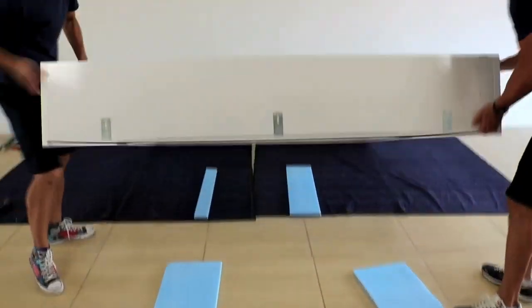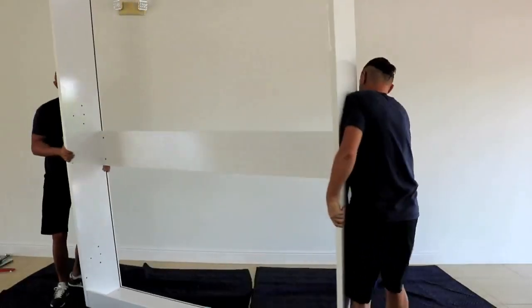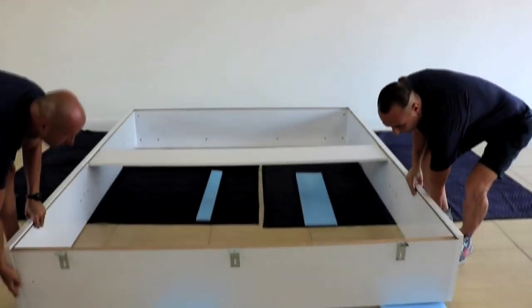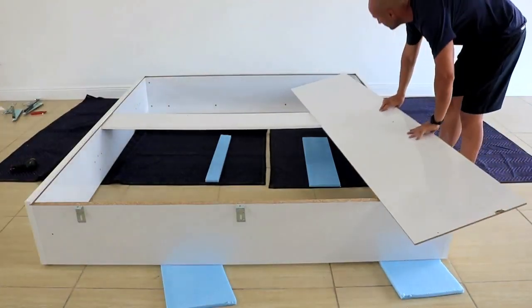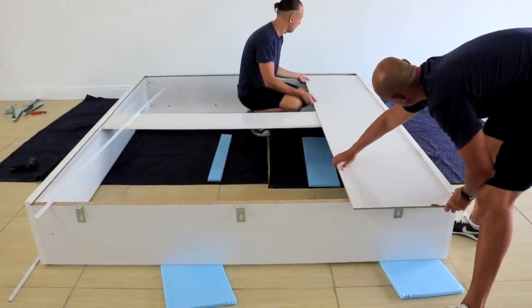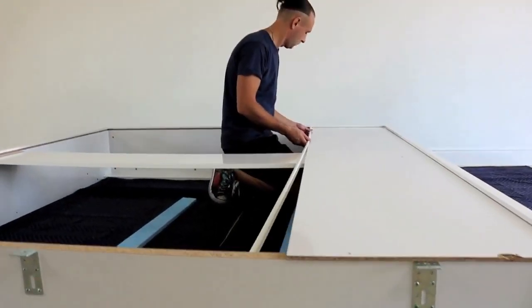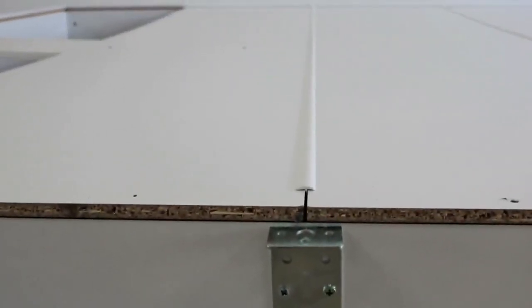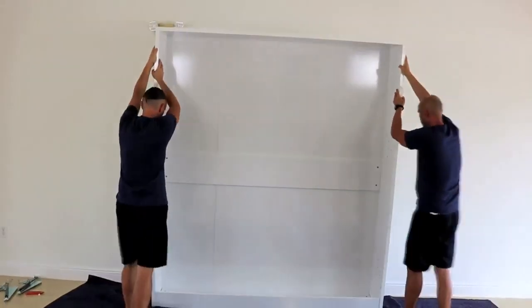Close the frame and lock cams. For installation of the four F panels, flip the assembled A, B, C, D, and E panels face down. Insert the first F panel into slots provided on panels D and B. Make sure the first F panel is snugly secure. Then place a plastic gasket before inserting the second F panel. Check for snug fit and then repeat with F panels three and four. Once all panels are inserted, carefully lift the whole assembly into upright position.